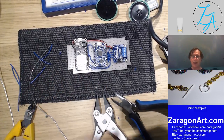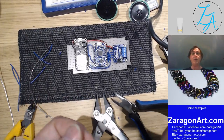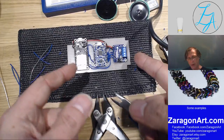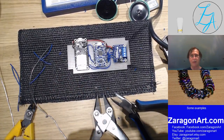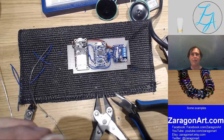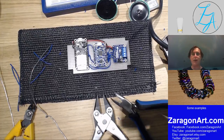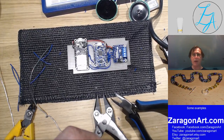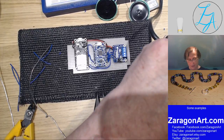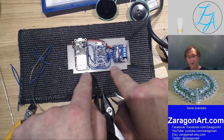You know, if I'm here streaming, for example, and somebody came to my front door to deliver a parcel, I wouldn't know. So what I have is my own doorbell design. The front doorbell is a Wi-Fi unit. When you push it, it connects to Wi-Fi and sends a signal to the home controller unit, and the home controller unit looks at the time, looks at his watch and goes, okay, I'll let the bell ring, and it sends a signal to one of these units.